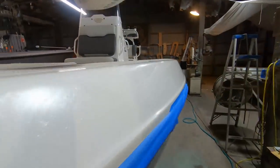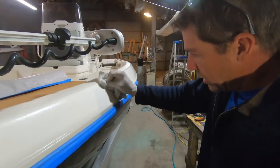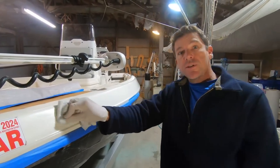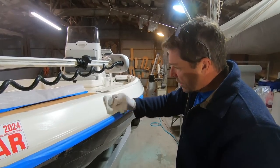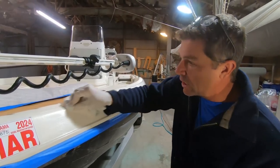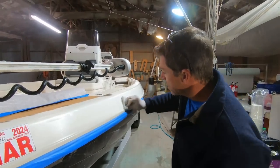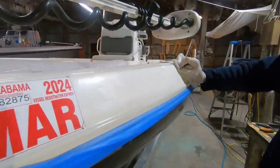Where we sanded back to the 2000 comes all the way back there, so I'm going to come all the way back and just blend and transition this in. We've got other videos on the channel — we actually have a real pretty dark green 19-foot center console that came in for some minor electrical work and we ended up going ahead and compounding the hull out. It turned out really nice — we did a color sand, a compound, a cut, a polish, and then a wax — basically what you'd call a full-on gel coat restoration.